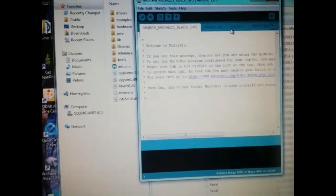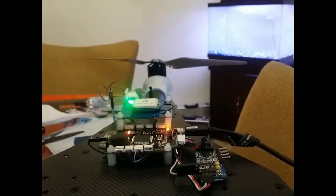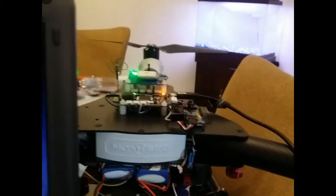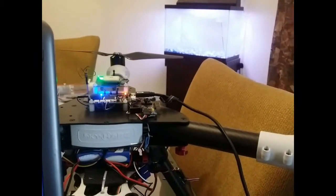If you do update it, you'll need your micro USB cord. Pretty much plug it up here and it'll light up the board. It's not like DJI — you don't have to have a battery to power it up. You plug it in and it starts powering up everything; you'll see lights start flashing. You don't have to plug a battery up to it like DJI stuff, so you don't have to worry about misfiring of the motors, because the computer's not putting out enough power to spin six, four, three, or eight motors — it's barely five volts going into it.